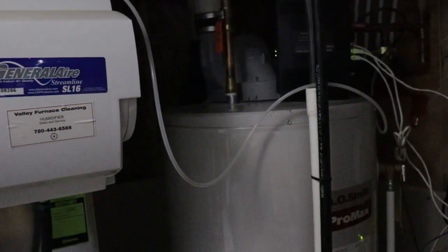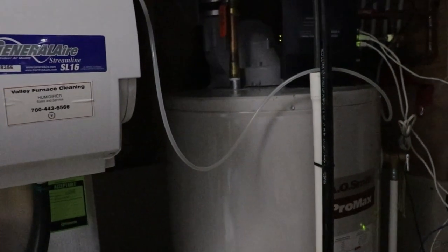So, if your anode was not connected to your hot water line and it was under your motor there, you won't have to do anything with your hot water line and put a valve on it if you didn't want to. You can always put a valve on if you want. And same with the union joint. You can do it as well, but you don't have to, because then your service is now the anode that is separate versus the anode that's part of your hot water line. So the reason why I did it this way, or the way I explained earlier, is because the anode is part of a hot water line and it allows us to service it in the future.